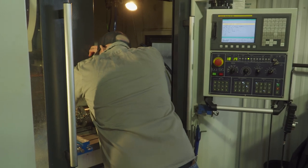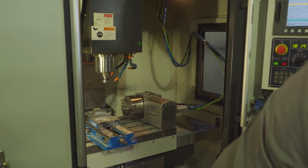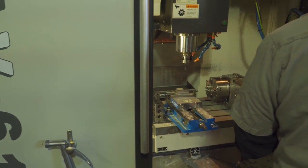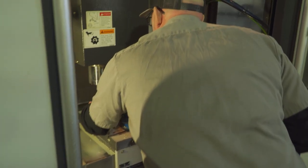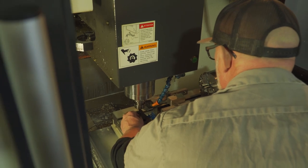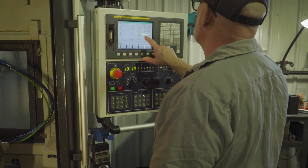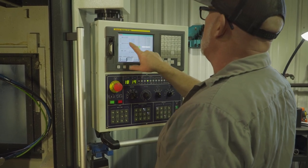Handle. Tool back in. I got to clean off my spot. Grab my four and a half inch block. I'm going to quickly do this to catch us up. Coming down — don't want to come down on my block. There's my tool 19. I'm going to go back into my setup page, page down, go down to tool 19. I'm going to hit measure. 15.718 — we're good.